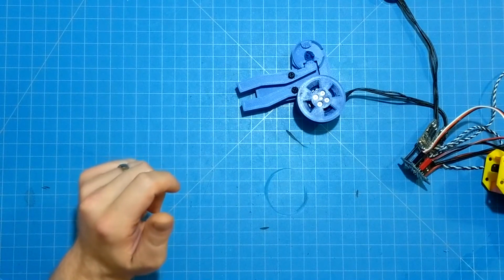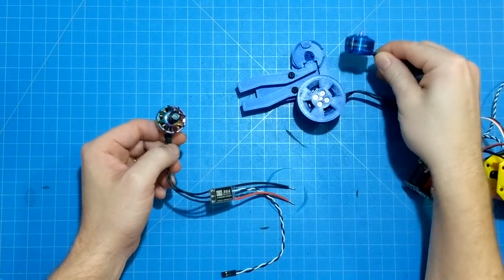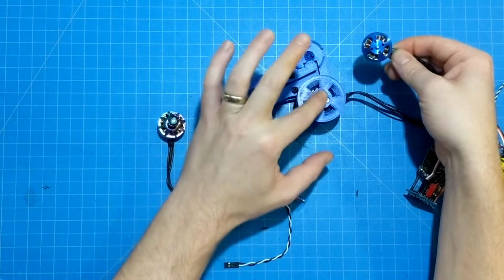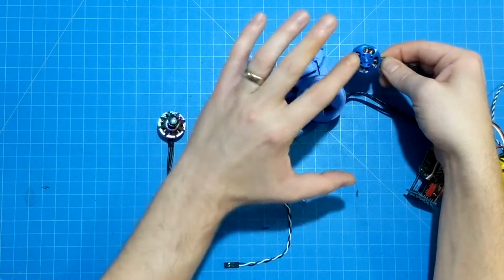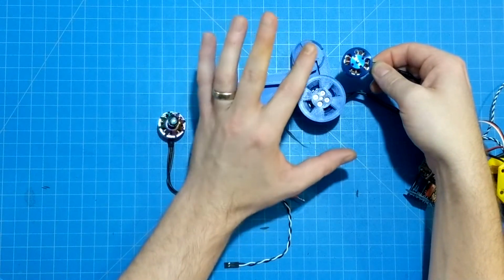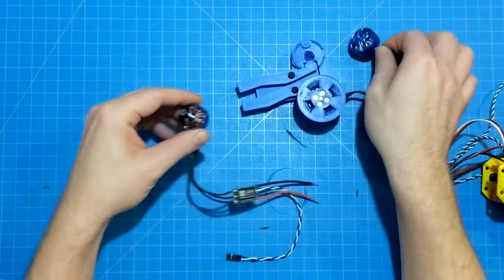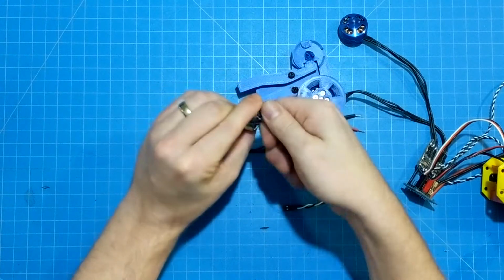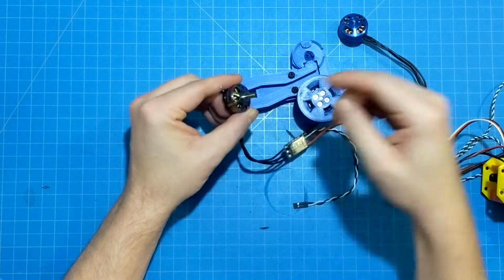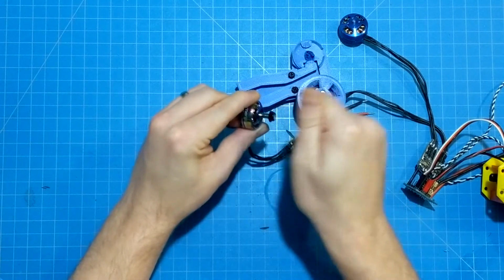A little bit of background. There are two major different types of brushless motors in particular. Our Crux motors that we just had made, the top has 4 threaded holes in it, and you can see on this flywheel there are 4 screws that screw in and hold the flywheel on. Traditionally on a drone or an FPV of some sort, there would be a prop adapter that screwed into place, and it would have a prop shaft like on this one. So this is a more traditional brushless quad motor where it has a propeller shaft in the middle, and then you have a nut that screws down on top and holds the propeller in place.